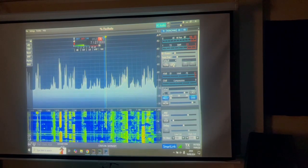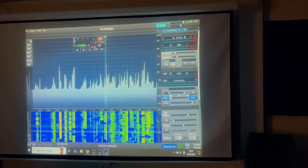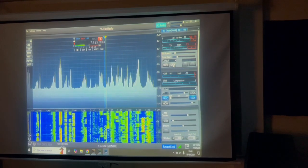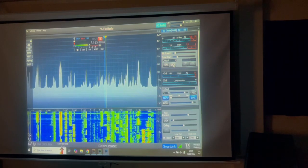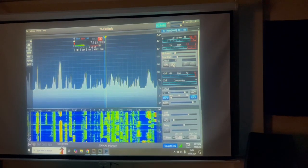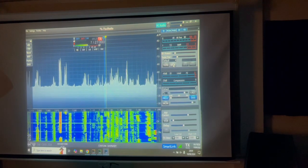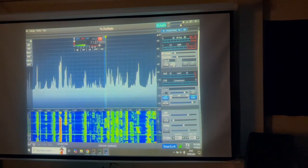Again, a real world use of the power of that is where you showed the Radio China International above the top end of 40. Obviously, Region 3 use that for amateur. So you can use the processing power of this to actually decode an amateur signal amongst that S9 plus 50 dB of Radio China International, and actually drag out the audio of an amateur operating, should we say, in Texas.